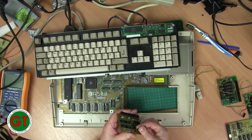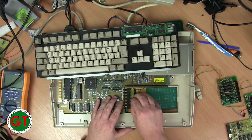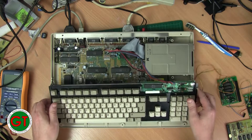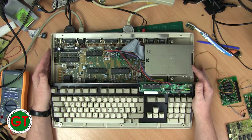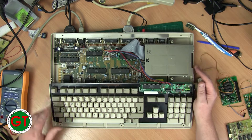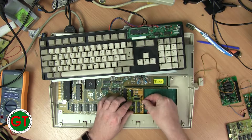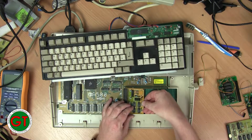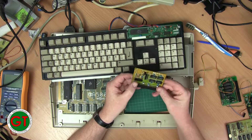Let's try this board next — we're booting, so that's a good sign. This one says battery backup clock not found, so that's not working. But the RAM expansion is actually working, so it's just the battery backup clock that's not functioning on this one. A lot of the corrosion was around the clock area, so it could be that the crystal has been damaged or the clock chip is bad. Maybe we can take the chip out.